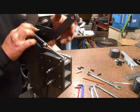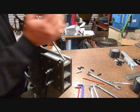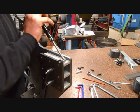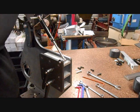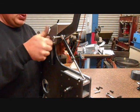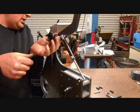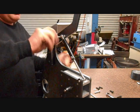Once that's done, we can put the gas strut in. It's very difficult from this side. If you're finding it's not going in properly, you might just need to tap the tension arm up or down. Once you get it lined up, it should just screw in perfectly — again, a 12mm spanner just to do that up. We need the 8mm nut — pop that on the tracking mechanism thread. Then the knob, bottom the knob out on the thread, and then a 13mm spanner to lock that against the knob, and there's your tracking.